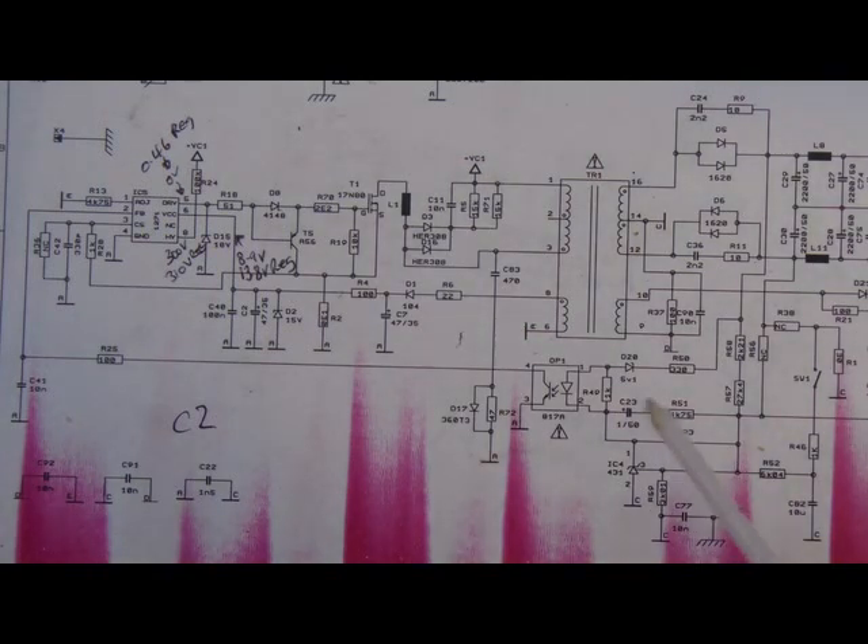I've been having a close look at the schematic for the power supply trying to solve the puzzle of why it doesn't go into regulation. It's as though it needs just a little bit more time - something's not happening quick enough, and this PWM regulator chip is shutting down or restarting. While it was running before, I measured the supply to VCC: when not regulating it was between 8 and 9 volts, and once it came into regulation it was 13.8 volts. The datasheet for this chip shows VCC minimum is 10 volts, so perhaps it's not getting the power it needs and just goes into a boot loop. I pulled out these two capacitors which I thought might be responsible for the slow startup of that part of the circuit.